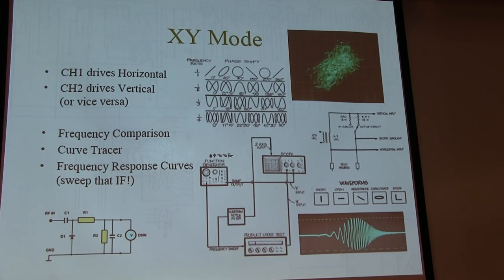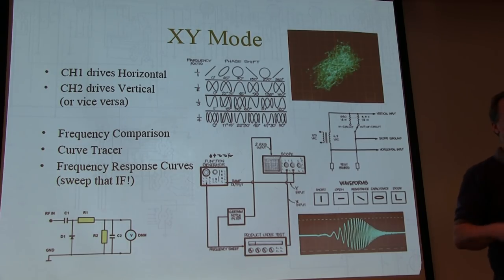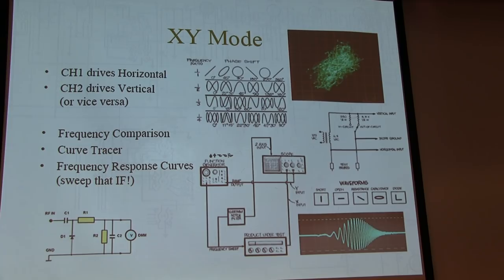Yeah. Al Kleiss once gave us a lecture on using a sweep generator to set up the IFs in a radio. But I was looking at some 1950s Radio Television News, and they had two articles on doing that exact same thing. Yeah. And they said, setting up your radio that way separates the men from the boys.